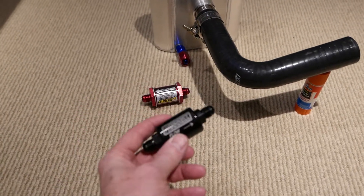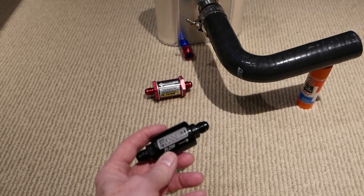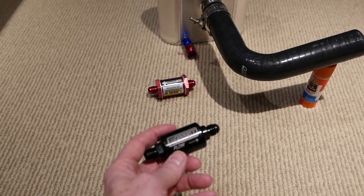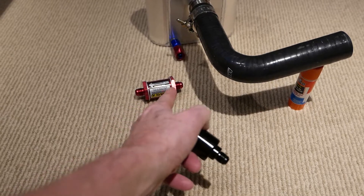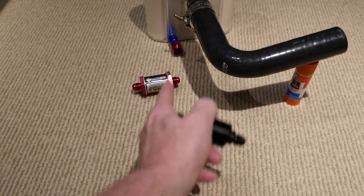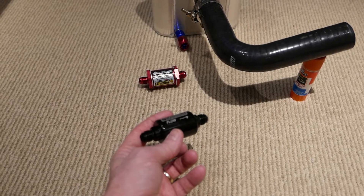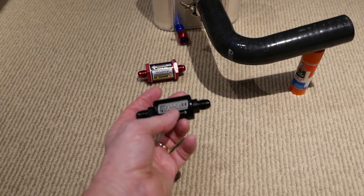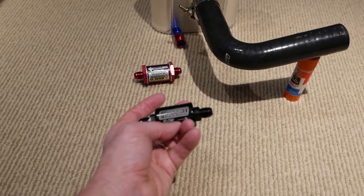Here's a Russell valve that I tried. This is great for a fuel injection system, but it takes too much pressure to open the flow. I just need gravity — all I have available is gravity to flow through. If I put this to my mouth it'll flap open and close very easily, but this one I can't even open with the few psi I can develop with my mouth.